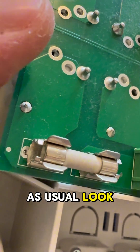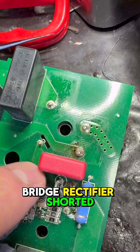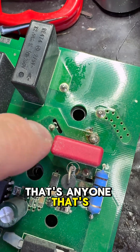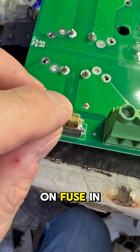As usual, the fuse isn't soldered in for a change — fuse is dead. Bridge rectifier is shorted: it's shorted that back and that together. That's the only one that's not shorted to the rest of it, but those are all shorted together. Let's get it off.